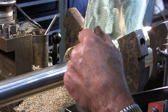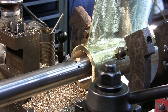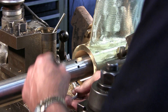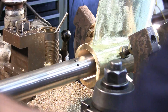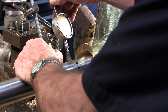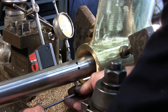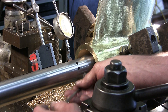We put the bit in here and slide it back — we're pretty close to the same length. We drop it back down in here and get it just inside the bore. I bring it out to where it touches and give it a slight tension there. Now I'm able to put my indicator on here, push the button, and set zero.